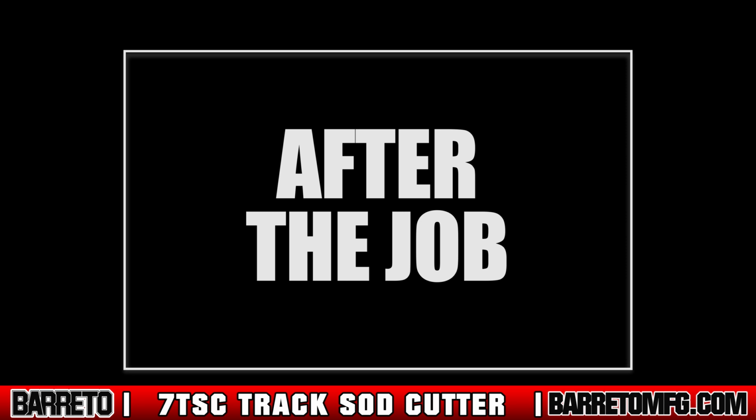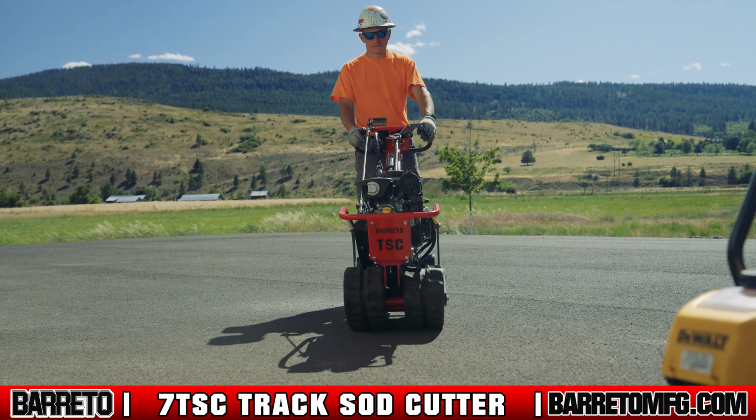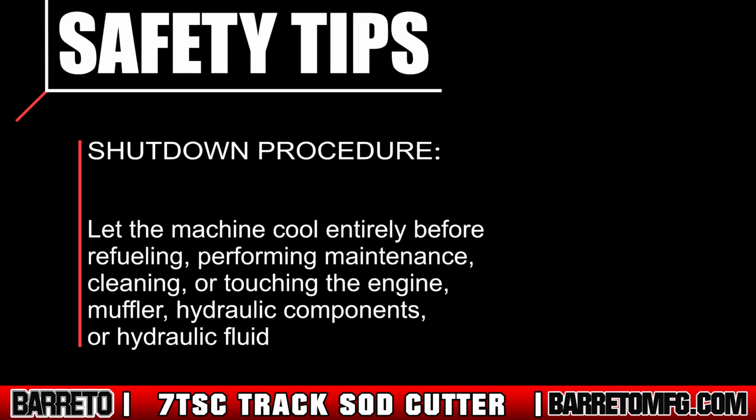After the job. Once sod cutting is complete, move the 7T to level ground and park. Lower the cutting blade onto the ground. Perform the steps in the shutdown procedure. Let the machine cool entirely before refueling, performing maintenance, cleaning, or touching the engine, muffler, hydraulic components, or hydraulic fluid.